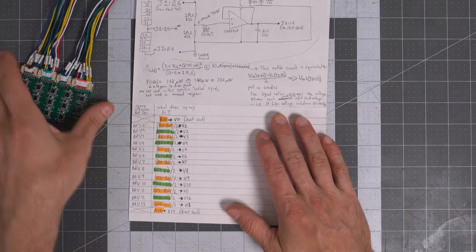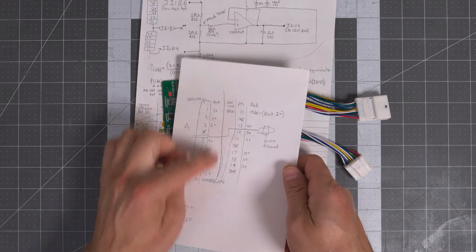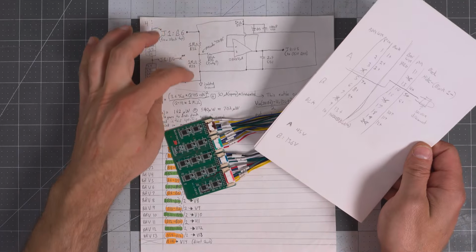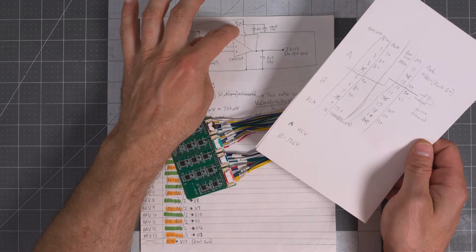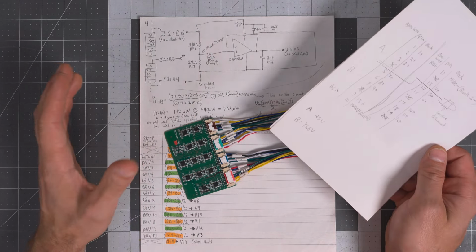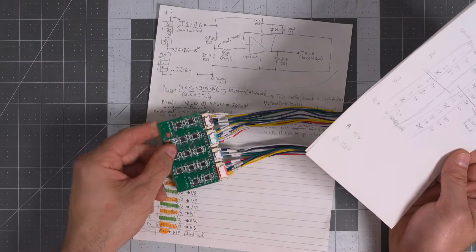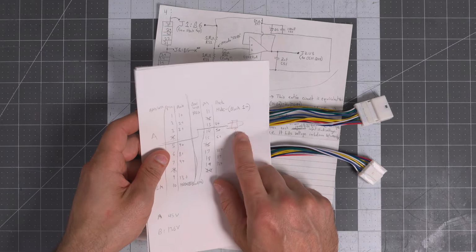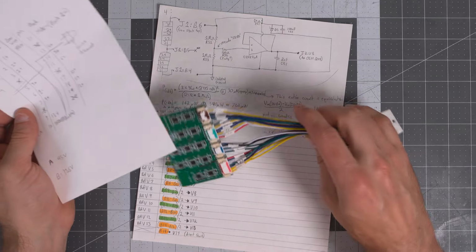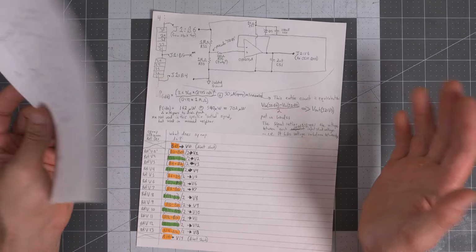This circuit's always connected, so when you pull the service disconnect plug out, you still have high voltage. Now, granted, it is across a large resistance just because of this 1 mega ohm resistance here, but you also have a 1K here that is bleeding through. It's pulling about 50 microamps or whatever. It's dangerous. When you pull that service disconnect, the goal is to make it safe for the operator. When this is plugged in, the service disconnect's primary feature, that you split the pack in half, is compromised. Now, granted, again, it is through a high resistance, but it doesn't matter. When you're doing high voltage, high resistance is not a safety issue. It doesn't make it safe, rather.